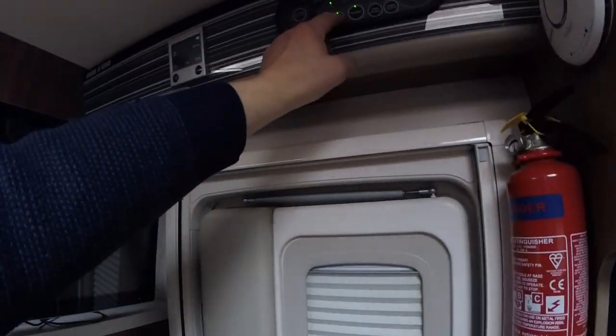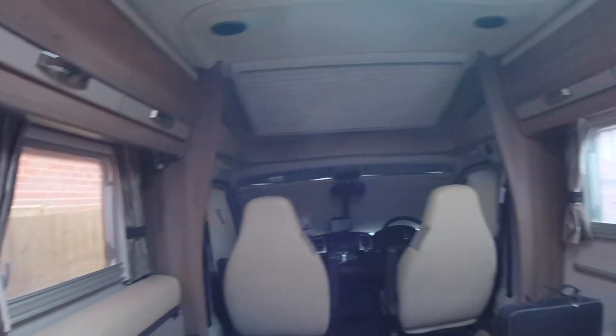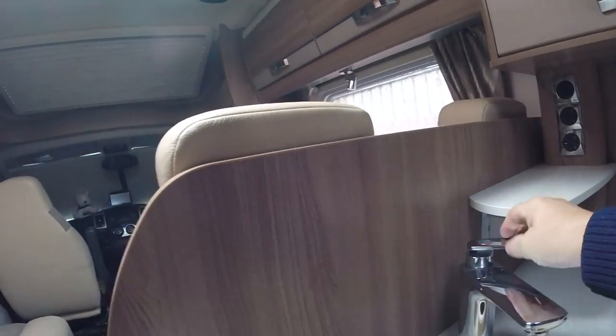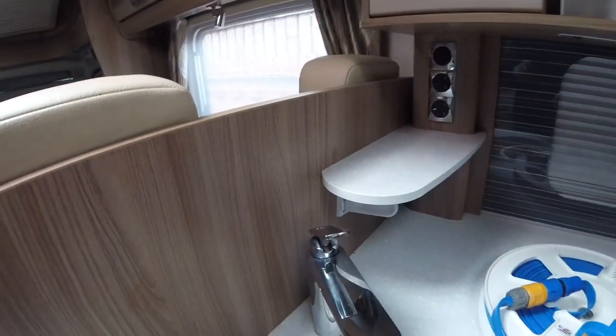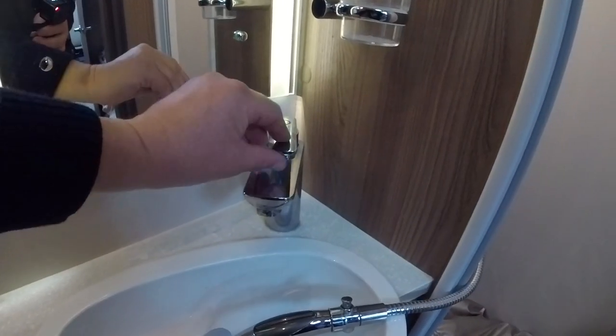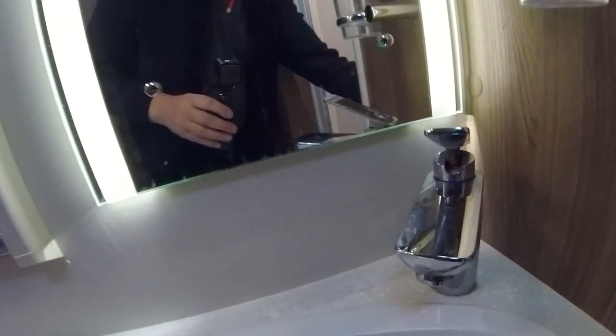It's the following day. I've just got to empty out the solution out of the tanks, so I'm just going to drain the tanks as per normal — open the drain taps, let the solution out, and then give it a good flushing through. Empty the boiler. I'll open up the taps and put them in the mid position, as you do when doing a drain down. Same with the bathroom and the shower.